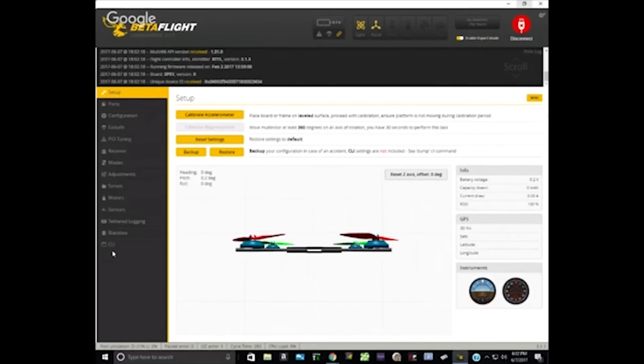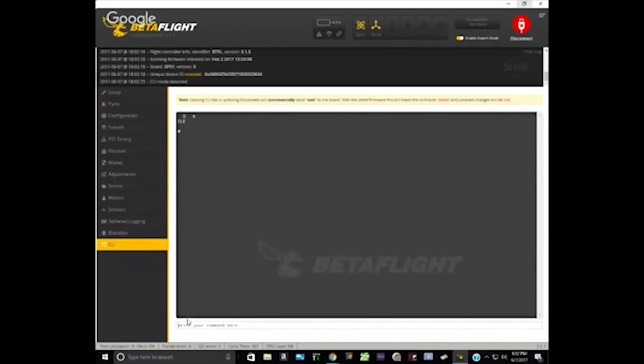So okay. Now you said that 1140 is the point where, when you go to the motors tab, the motors spin smoothly, right? Yeah, I think this is the default, so it's like 1148. So I just went ahead, just for conversation's sake, since I never even did this before, and set the min throttle at the same thing, maybe a little bit lower, maybe 1120. And actually, I think it's still at the default. I checked the min check, and it was at 1100 in the CLI.